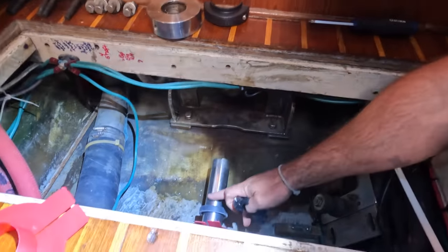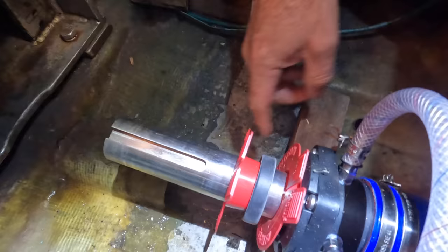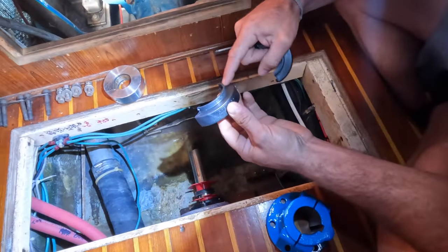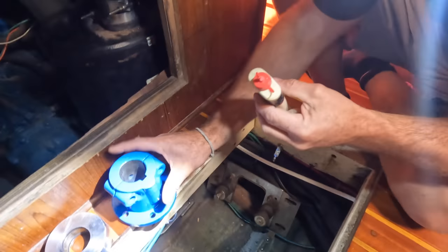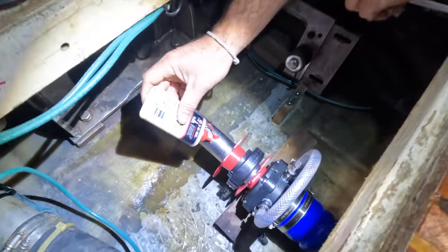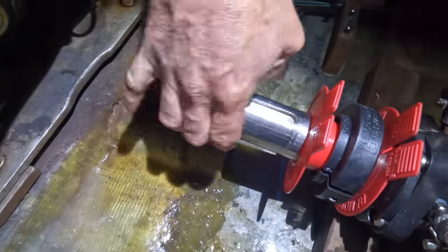I'm only going to loosely install this because I still need to slide the shaft forward. I'll leave the carrier set on the shaft — you probably don't need it just for sliding down the shaft, it's more for if you have an imperfection. I'll put it on anyway. This goes forward and holds the carrier for the lip seal. I'm going to put the flange back on and put a bolt in there so our shaft doesn't go and sit on the bottom of the ocean. Let me put a little bit of oil on this — I don't want anything to slide back onto our spare carrier or lip seal.